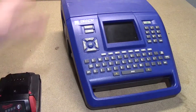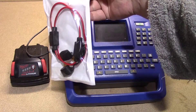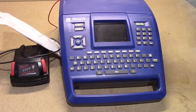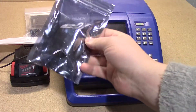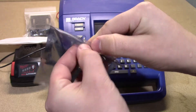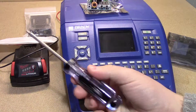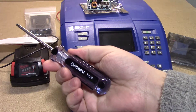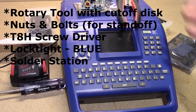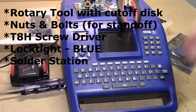You're going to need your BMP71, an M18 battery, some wire, a circuit protector — just a fuse — the adapter for the M18 battery, a circuit that allows you to monitor the voltage so you don't overdraw from the battery, a T20 screwdriver, and likely a pliers. If there's something I missed, I'll put it up on screen, but I'm pretty sure this is all I'll need.